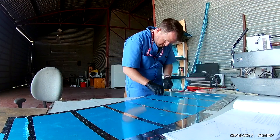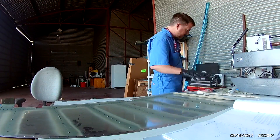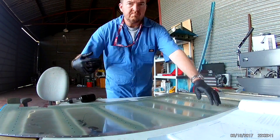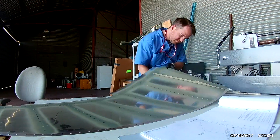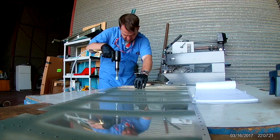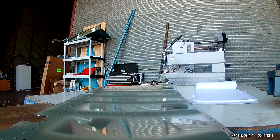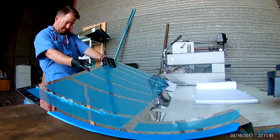All the dimpling is done. So what I do is I have my 3/8ths inch cold rolled steel back rivet plate out on top of the table. Now it's not flush mounted, and that's kind of one of the problems that happened last time. You always have to make sure — because it's not flush mounted — your skins will hang over the edge. And if you try to rivet onto 16 thousandths of an inch skin that doesn't have any backing, that tool will just go straight through that metal. So I have to be very careful about exactly where that back plate is.